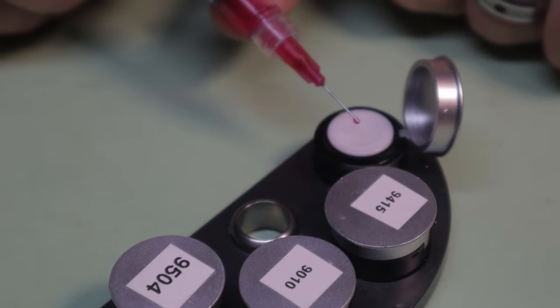With the cost of lubrication, anything you can do to prevent waste and save money helps. I store my main oils — Mobius 9010 and HP 1300 — in syringes. This allows me to dispense only a very tiny amount into my oil pot, eliminating the waste from the tweezer or screwdriver dipping method. You can buy a small quantity of these syringes for about $7 or $8 on Amazon — just make sure they have the thinner needle. That's it for this video. In the next video we'll cover lubricating the pallet jewels as well as the balance jewels.